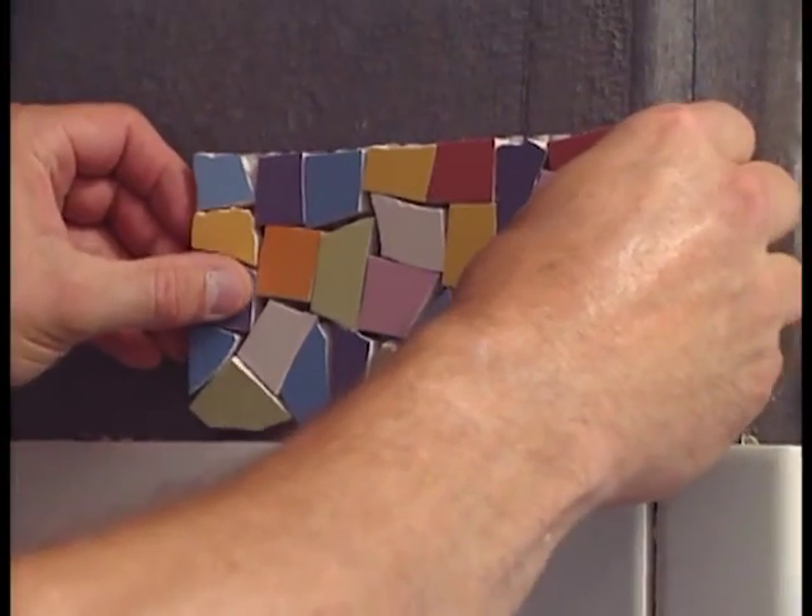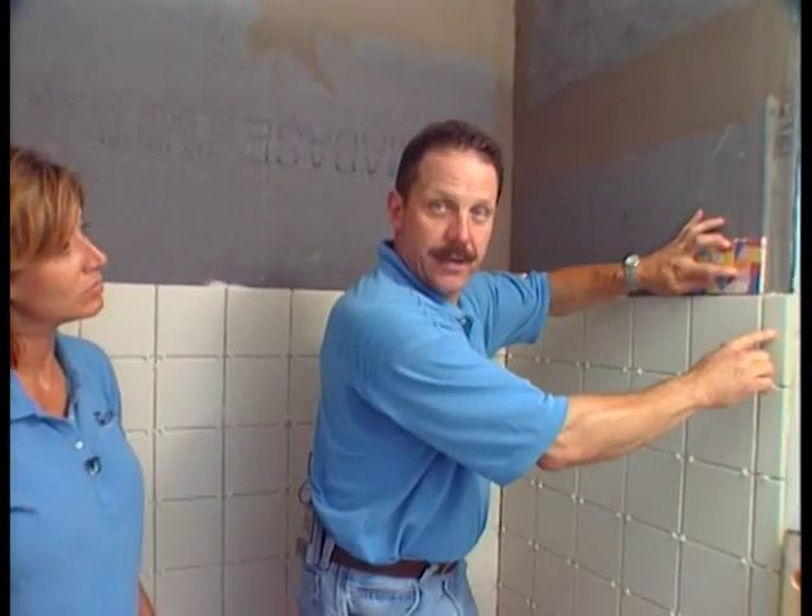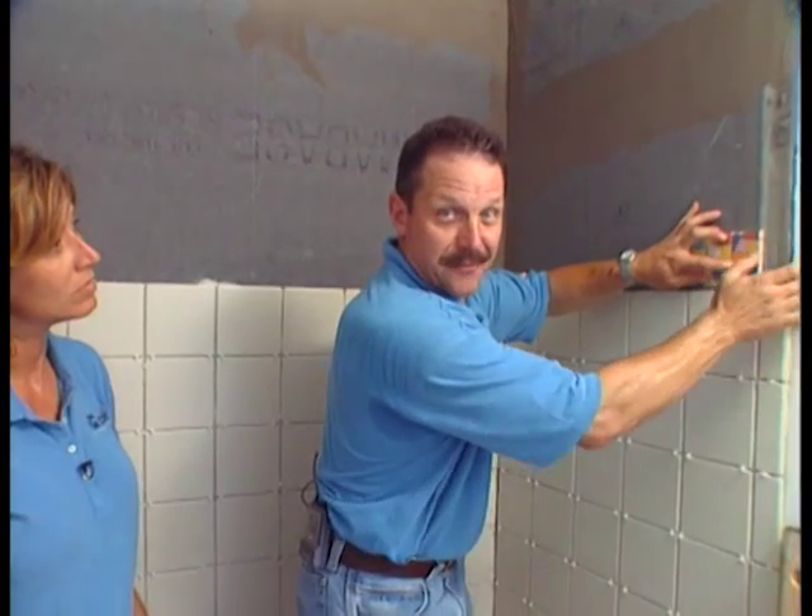We're three more levels up. We've put our level on to make sure it's all flat across the top, and we are ready for our liner — or what some people call a border. Some say it needs to go at a chair rail height; some say at eye level. Personally, I like to walk into a room and let my border make a dramatic statement, so I'm prone to take it even a little higher than eye level because it creates a nice little element. But it's really up to you. You'll notice this has a real rough edge, so it's going to go behind our surface bullnose, and a cut piece of surface bullnose will finish this edge.